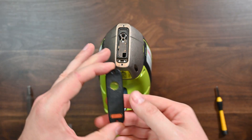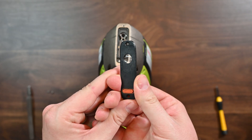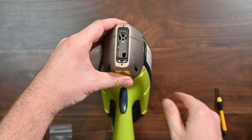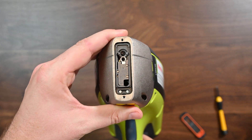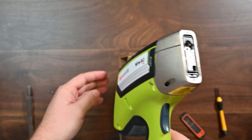Then you're going to remove this front faceplate, and you'll be able to see in the light that little thin film window there. That's going to seal your analyzer — it's going to protect the x-ray tube and detector, which is what we can see here. You'll be able to see the x-ray tube and detector. Very cool.